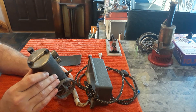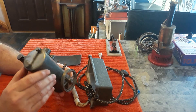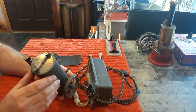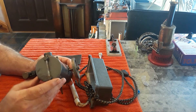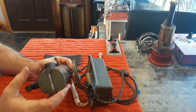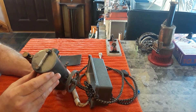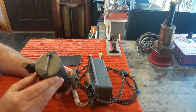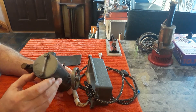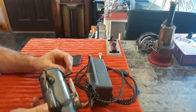Got in there, dried her all out, cleaned it up. Soldered on it a little bit — wasn't having a whole lot of luck getting the solder to stick to that old iron. But then I resorted to my old friend, JB Weld. We very carefully packed her full of JB Weld, got a stick in through the fill hole, piece of wire bent over to hold it on the backside and kind of smear it around from the inside. I think once I put it all together, it's going to be below the cast iron base and you won't even be able to see it.